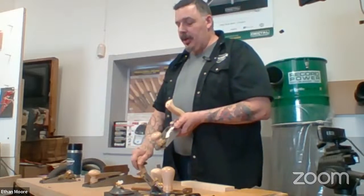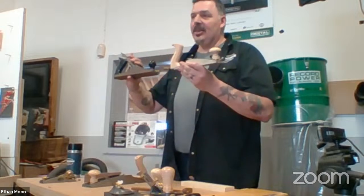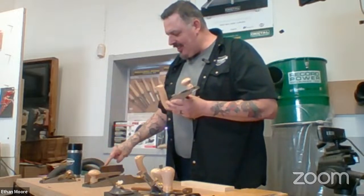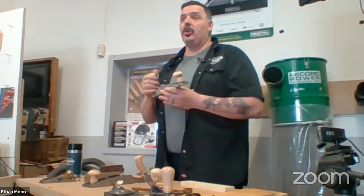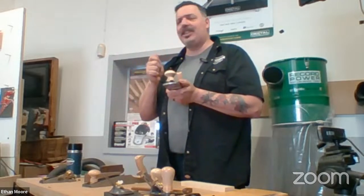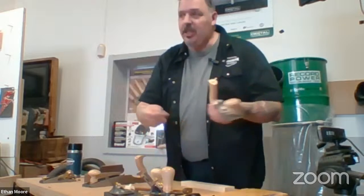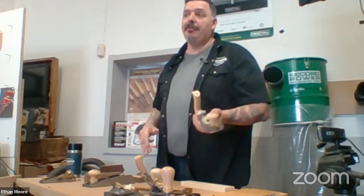The reason I don't recommend people start with the smoother is because this thing's really a one-trick pony. Every second woodworker has the smoothing plane as the logo for their business — everybody's got a number four. This thing doesn't have a flat side, so it wouldn't be a good shooter. The smoother is basically a 150-year-old random orbital sander. This thing would be set up with the super sharpest blade you could create, and you would take nothing but super fine shavings just to clean off road dirt, pencil marks, little bumps and dings — it was just that final bit of work you would do before you applied finish.